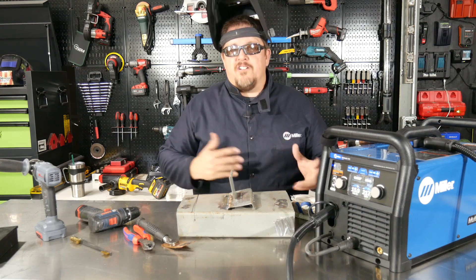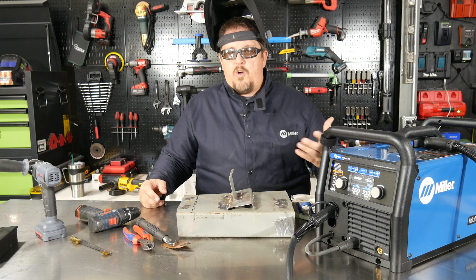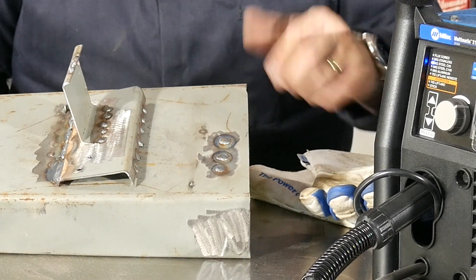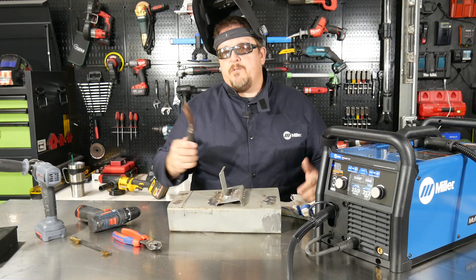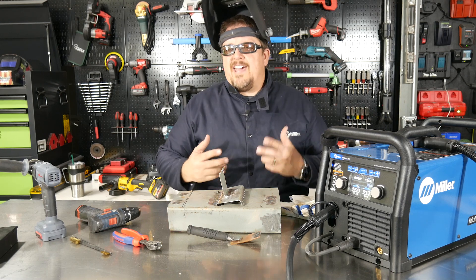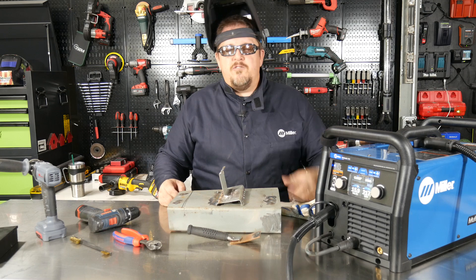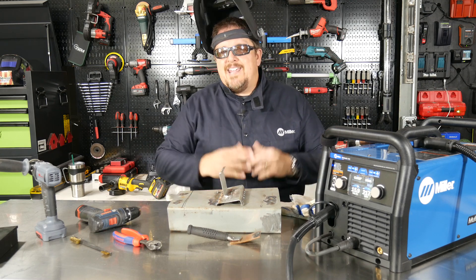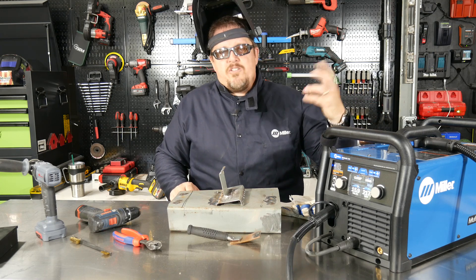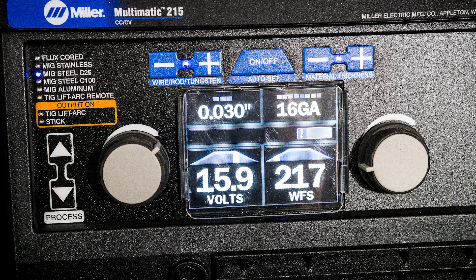After quickly taking our DeWalt grinder to clean those welds up, there are a few pinholes to fill with some filler, but there are no voids behind it — no moisture is going to wick in from the backside to create corrosion. We've filled holes in sheet metal on the desktop, which looks really good and really flat — a quick cleanup with probably zero voids. It's not hard to do, especially with a welding spoon, a $10 to $20 item you can use over and over. On larger holes like the trunk lid, you do have to work into it — I had a little trouble getting them started, but once started, cool them off, come back, and do some more. Any MIG welder is going to work — in our case the Miller Multimatic let me dial in the metal thickness by gauge and fine-tune wire feed speed and voltage output. Whatever you do, stay safe and wear a welding helmet to protect your eyes.